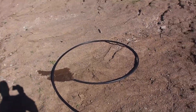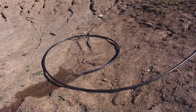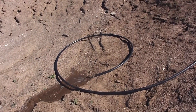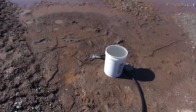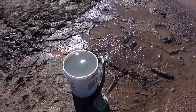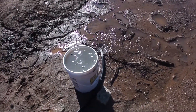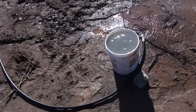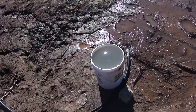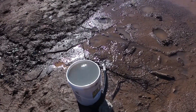Here it comes — it's flowing. That's supposed to be max flow rate right there. I don't know exactly what it's pumping out at. The pump could do 7 to 8 gallons per minute, and my well could do 12 to 15. I checked it with a 5-gallon bucket, timed it twice, and we're getting about 5 gallons per minute, a little bit less — which isn't that great since it's supposed to be 7 to 8. However, I do have the solar panels laid horizontally on the ground. If I get them up in the air at the proper angle facing south, it'll probably put out maximum water output.